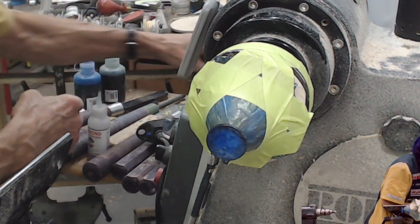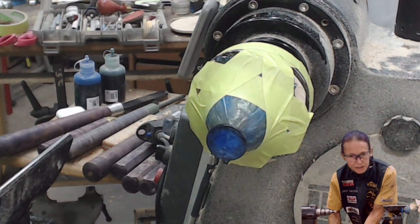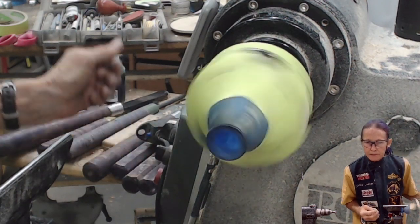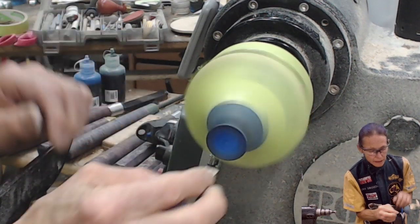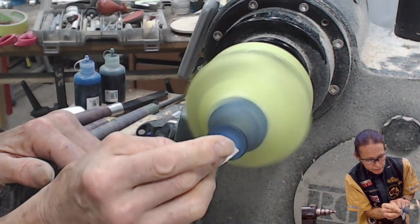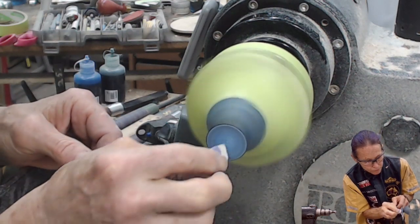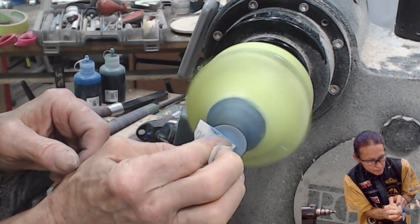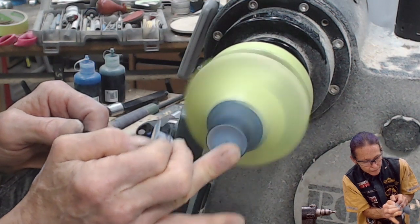Normally what I would do is I would be putting on six coats of water-based finish, and then after the finish was all dry, that's when I would be signing it — but I would have sanded it of course while it was on the lathe at a point like this. So I'm sanding here starting with 400 grit, and I'm happy that I'm sanding a bunch of the color off because that's going to make it look kind of nice.